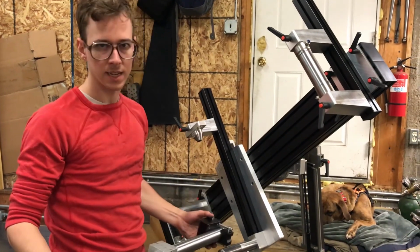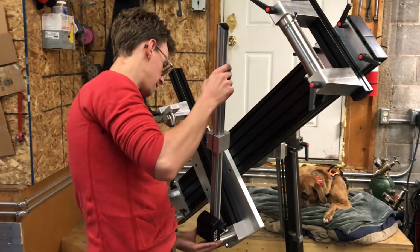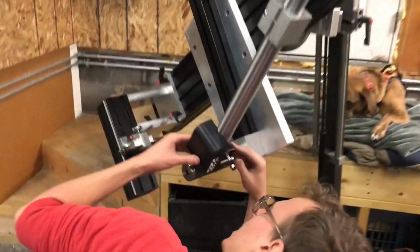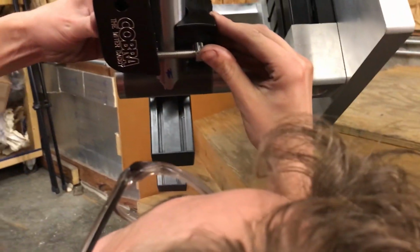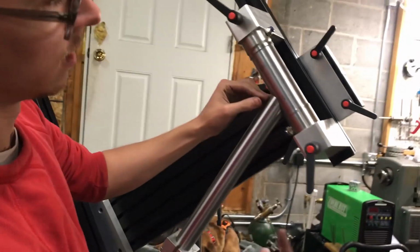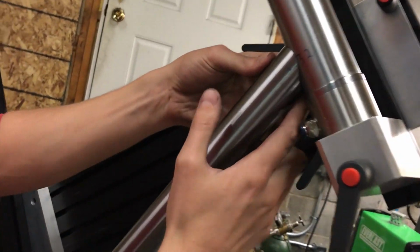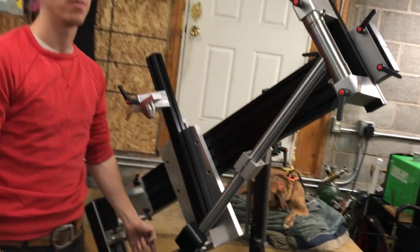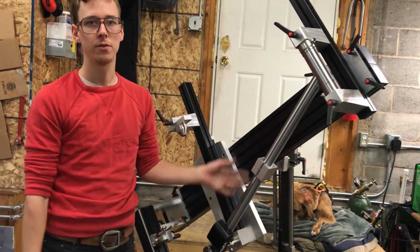So this fits decent now. If I set it on the bottom bracket shell, I tip it down, I check that it's centered on the bottom bracket shell, and what we have is it's sitting a little bit high up here, and it's a little bit more of a gap at the bottom than at the top. And so at this point, I feel like this miter for the bottom bracket is as good as it needs to be off of the machine.